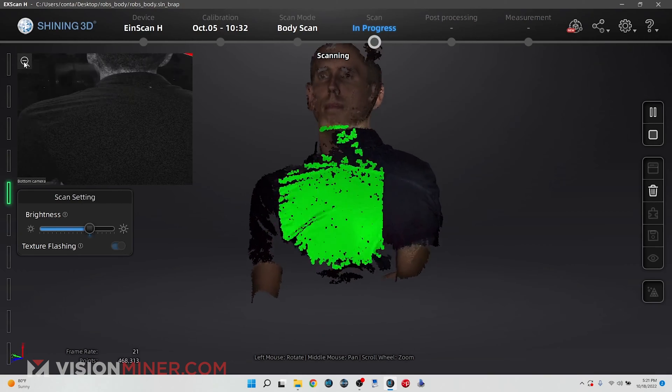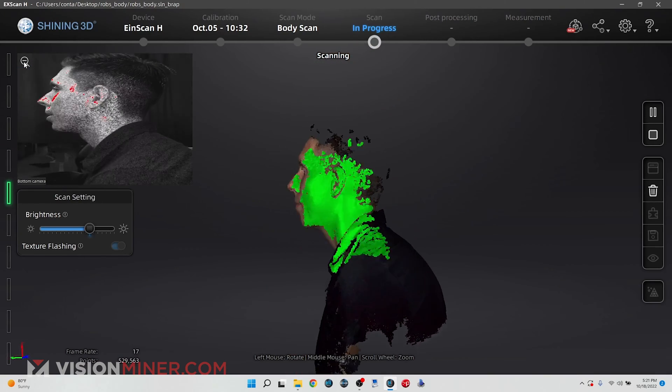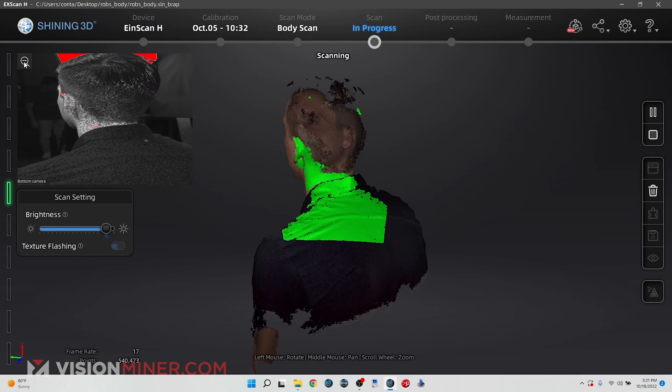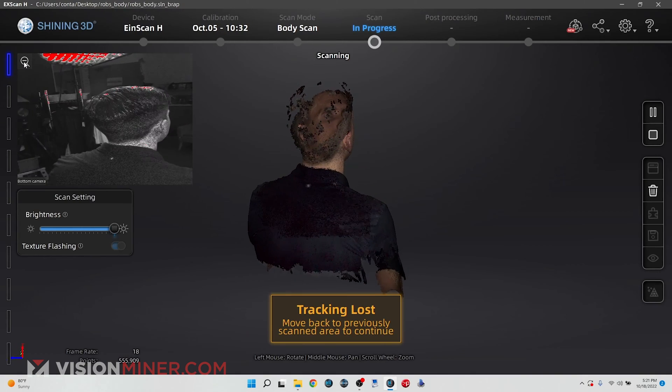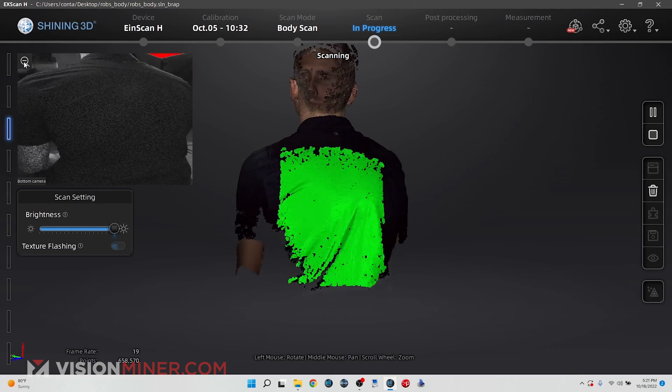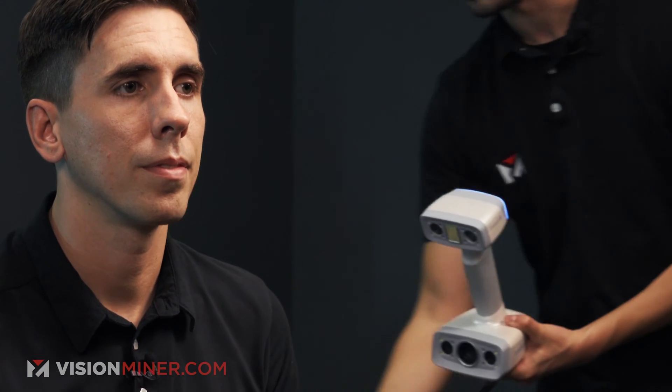You do sometimes have to adjust the working distance and brightness a little bit, but usually stock settings work pretty well out of the gate. I'm adjusting the brightness to capture some of Rob's hair — with this scanner it is a bit harder to capture hair because of the thinness of individual hair strands. But for most applications we don't really need to scan hair since that data can be replicated in software. All we need are the specific facial features and body parts so we can capture those features and measurements. With that, we're able to complete the face scan.